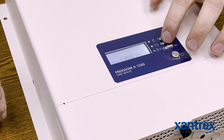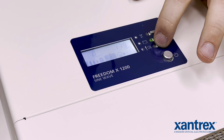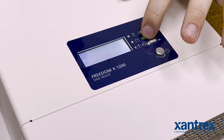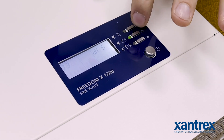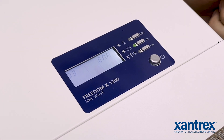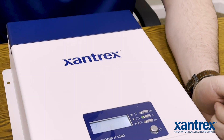We go to load sensing, which — again, you're going to push and hold the OK button and go to setting number three. That is disabled, and again you can hit the OK button to cycle through disabled and enabled. That is simply turning that power save mode on or off. We call it load sensing, and that also just immediately changes the inverter to where you will only have the inverter active if you are using more than 25 watts of power.